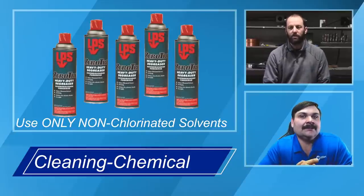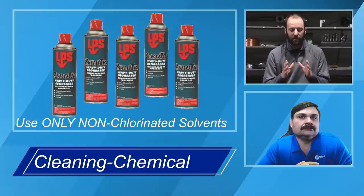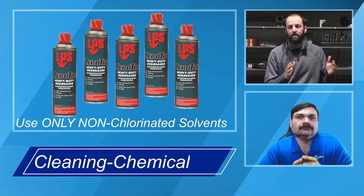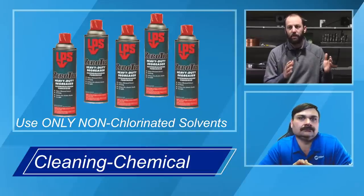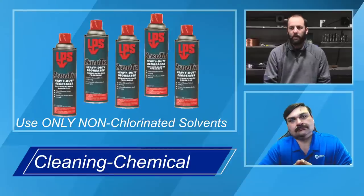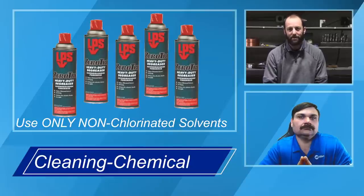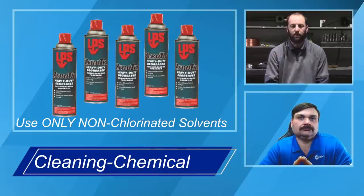Yeah, and generally what we're going to be doing is cleaning not just right where the weld is, as Travis mentioned, but we're also going to be cleaning back an inch or two from that at least, depending on the condition of the material and how large the part is. If we think about oil, for example, or wax, like a saw wax, Travis mentioned material prep, which we'll cover here in a little bit.